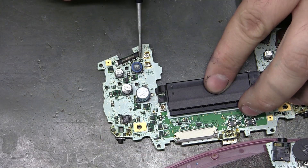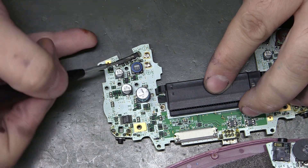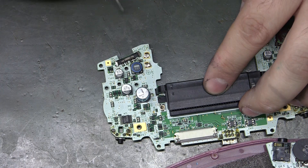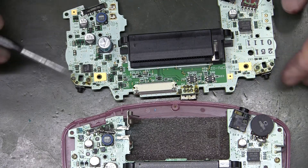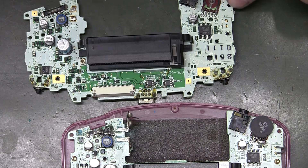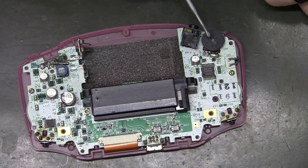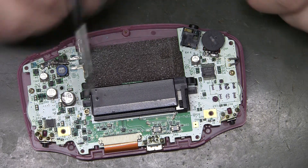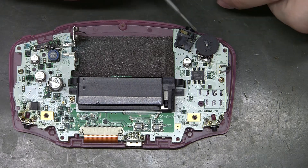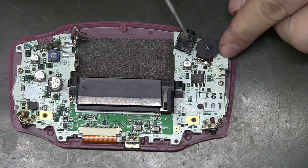Fuse one looks like it has a 'J' on it, so you can solder to either side. If you're having trouble with that left pad, this is normally what I'd go for — except this has a component leg between the two pads and I'm going for a solder blob from the legs of the switch. This is just so we don't have to worry about corrosion and dirt in the switches and pots. With the LCD version, you do the power bypass with both versions. If you still wanted to use the volume pot — which I really don't recommend, as they're probably corroded — just cut the speaker off and blob it over for full volume output.